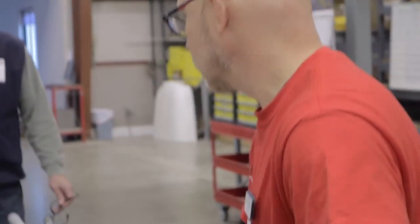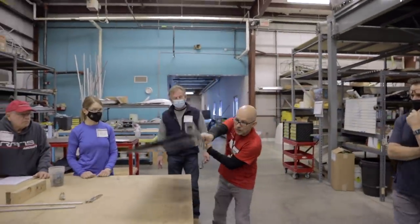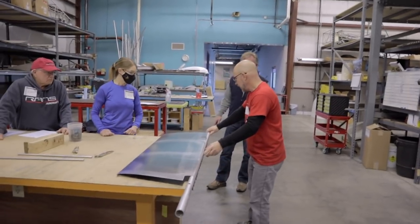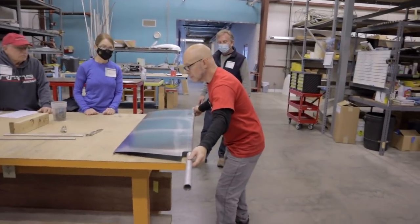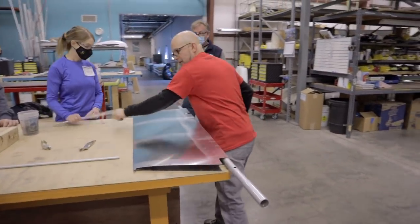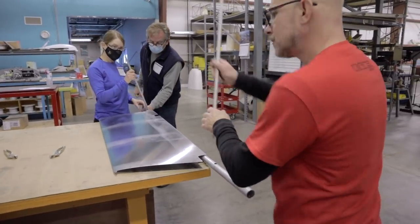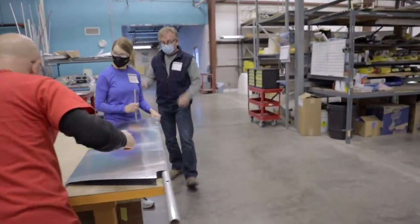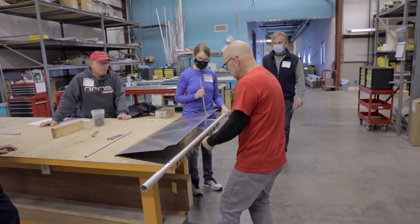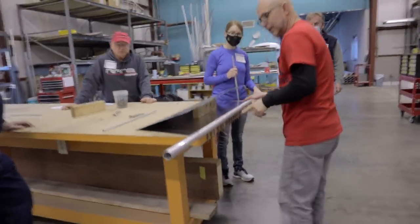You explain that, but we've got to take this, flip it over. We want the clecos on the edge of the table, on the very edge, and we need these two holes to be exposed. Okay? So these two holes, we're going to put these tubes in it, and we're going to roll this around. Put my hand there. Now, the reason for this block is that when we roll it around, the clecos will come around and catch this edge. They won't let us go far enough. So I just use this as a step to hold it in place there.